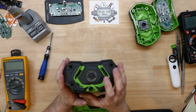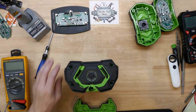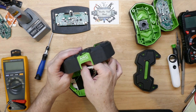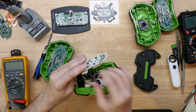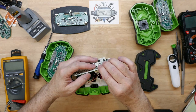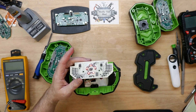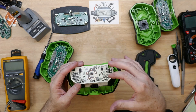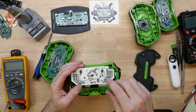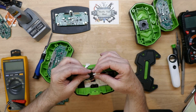We're getting green and then red, so we really do have a pack issue — it's not just the connector on that last repair board. It's probably not the board at all; we either have a wiring issue or a connector issue on the pack itself. I took the very first repair board just to double-check, and it also goes green then red, picking up a cell issue. These boards are acting a little differently with the flashing lights but are still showing a cell issue, so I'm going to have to dig into this pack deeper.